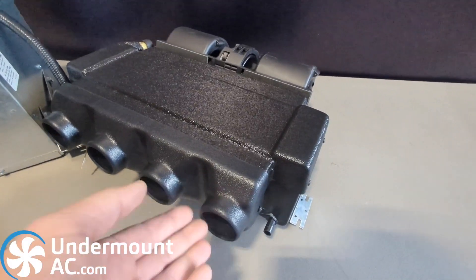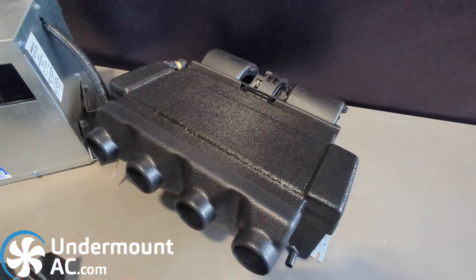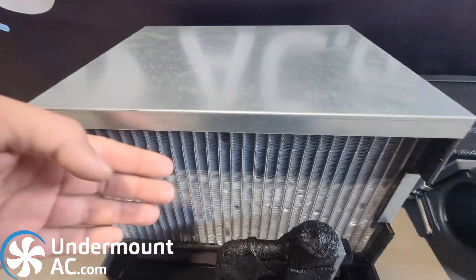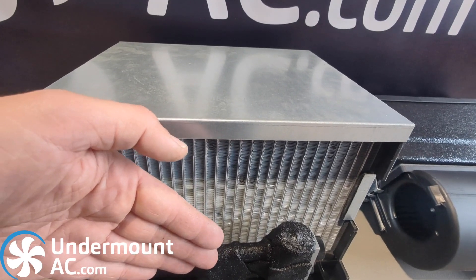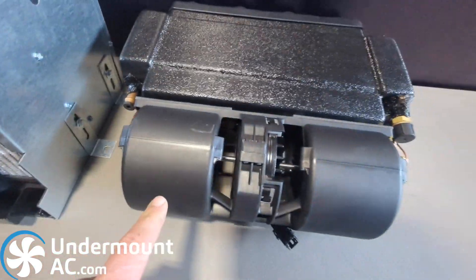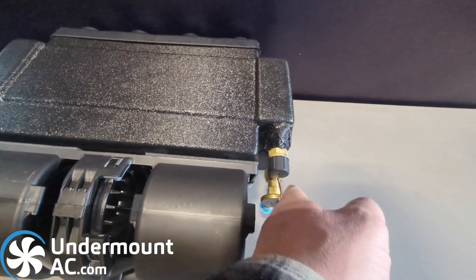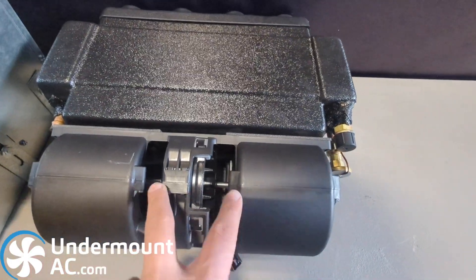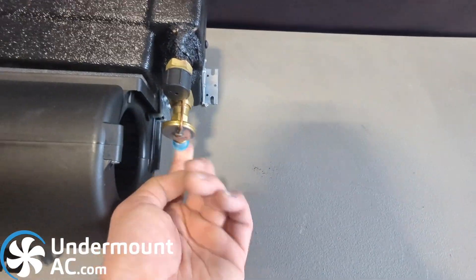These can also be adapted so you have louvers here for a flush mount style, allowing you to direct airflow in whatever direction you require. The cabinet evaporator requires an intake directly from the back, with a minimum of two inches from the back of the coil. The ports are accessible right here for the refrigerant lines. The HVAC evaporator requires spacing around the cabinet to accept air coming in from the right side, the left side, and the middle sections, with refrigerant lines attached on each side.